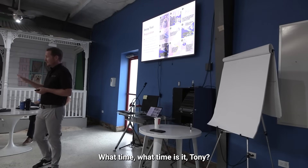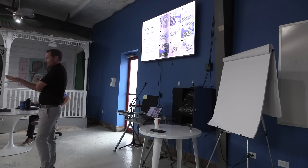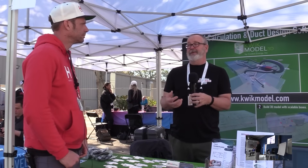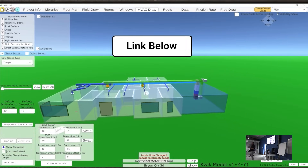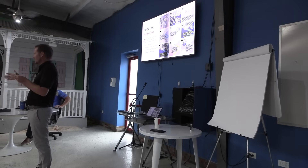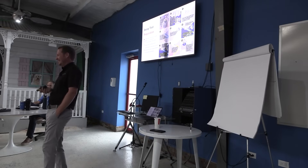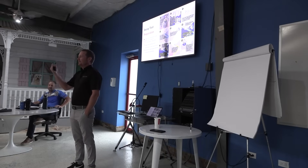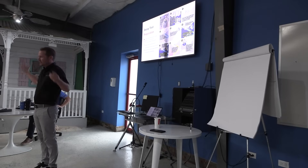If you're getting down to 1,200–1,500 microns, you're in good shape — you're well below the point where you're contaminated with water. It's just some molecules still making their way out of the oil. Half of you aren't even using micron gauges right now, so let's be honest. To put it in context: atmospheric pressure is 760,000 microns. If you're down to 1,500 versus 760,000, you're doing pretty good. If you're just listening to the pump, you may be getting down to 20,000 microns and thinking it's good — and that's not good.